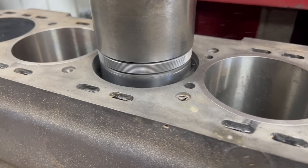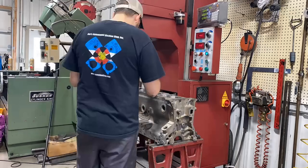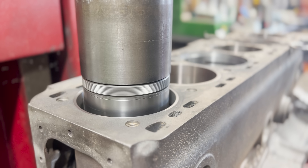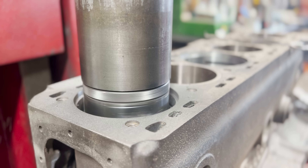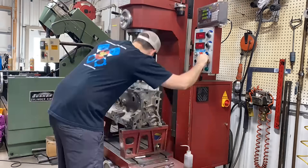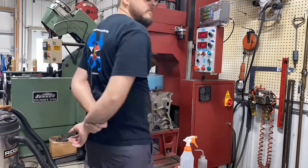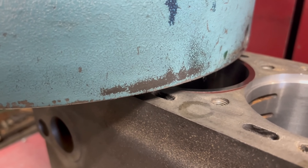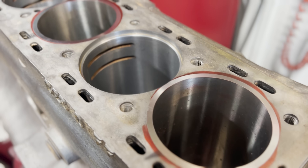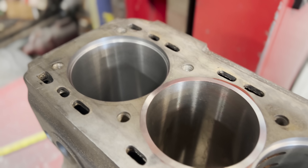The people who designed these sleeves set the flange dimension to a diameter that makes the sleeves just overlap. By having the sleeves just barely overlap it maximizes the surface area of the flange, giving the best chance of successful sealing from the head gasket. Now, if I had been thinking ahead I would have cut these next three counterbores slightly more shallow in order to leave the flange sitting higher up than the previously installed sleeves so that our press plates wouldn't bottom out before seating the flange. Since I cut them to the same depth of 245 thousandths, I went ahead and quickly decked the top of the first three sleeves to make sure that they would be lower and we would have no trouble with the install. This simply required switching over to the surfacing head on the machine, touching down and zeroing on the top of the sleeve, and then making a couple of passes to take four thousandths off the top.